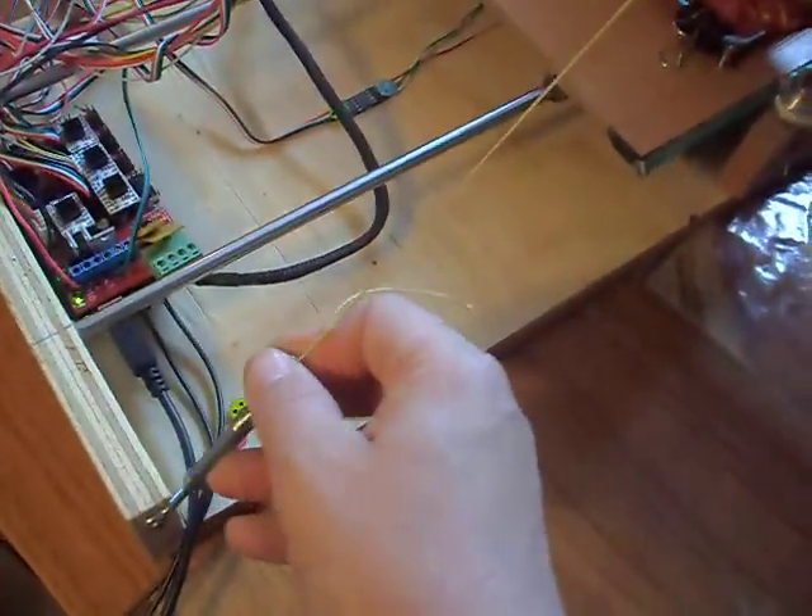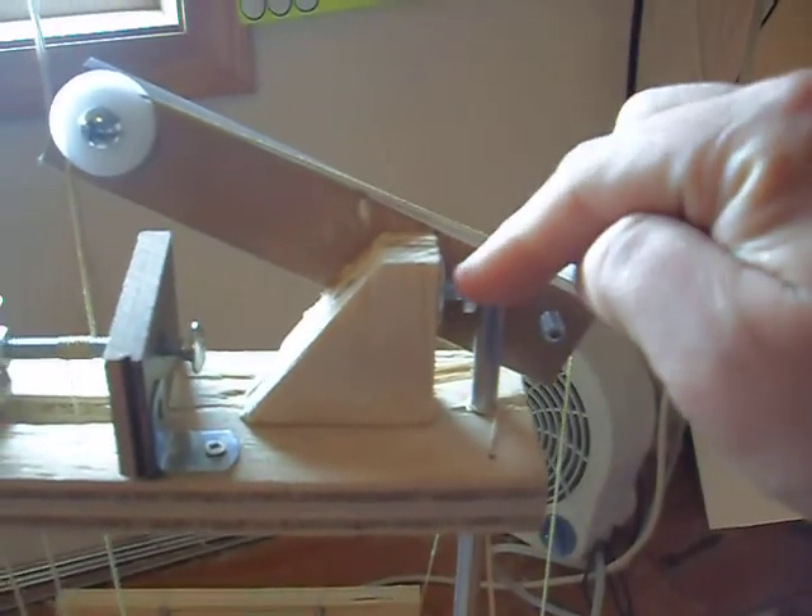I replaced it with 150-pound Kevlar and two turnbuckles, and four screws. The turnbuckle goes up, goes through this hole, keeps the top assembly from coming down, goes around the smooth rod, goes back down, goes all the way down here to another screw. I can actually fold this thing up pretty easily just by loosening this, and I can adjust it too — if you loosen that off you can go back and forth, move it this way or that way and then tighten it up again. If the entire thing has to move one way or the other, you just come up to the little devil horns here and adjust these — push one side one way or the other, snug up the other side, and everything's nice and solid.